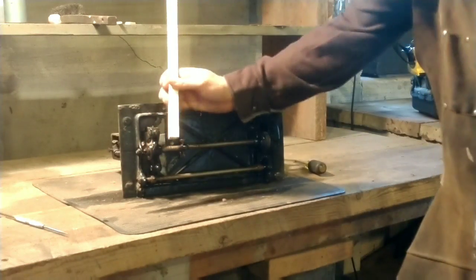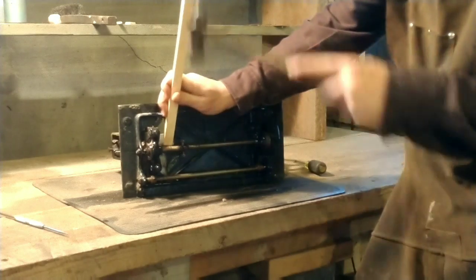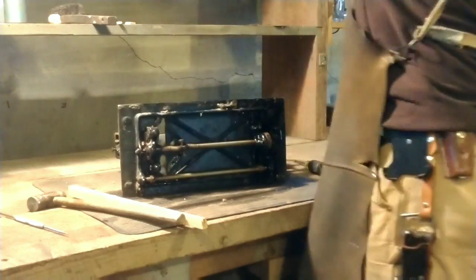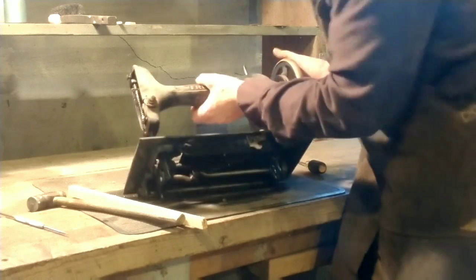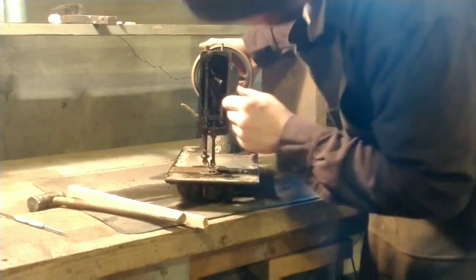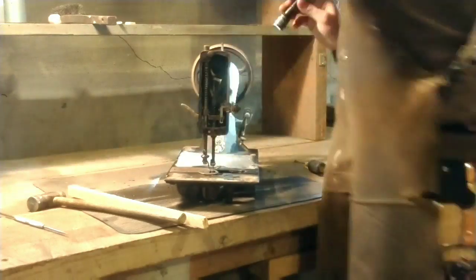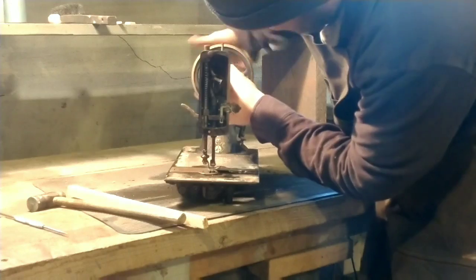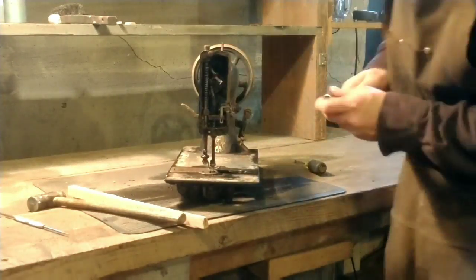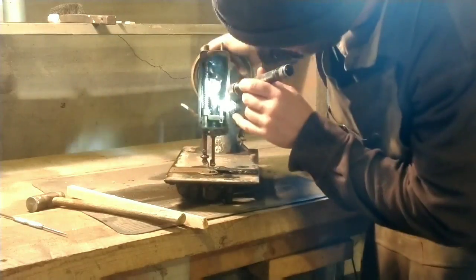I've got a little stick here and I'm making sure I'm not going to knock into anything — looking all around it, making sure you get an idea of what you want to drive it into. I'm locking my hand off firmly and just giving it a little tap. I felt it move a little bit. The shuttle carrier got freed up by that little tap, and now it's the needle bar itself that won't slide up through its bearing.